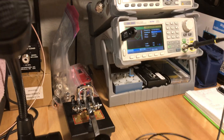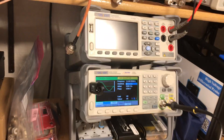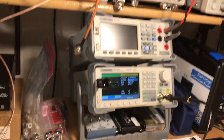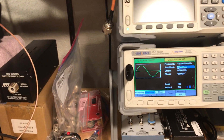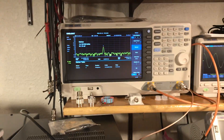The issue we were having is I didn't have a step attenuator — I only have a fixed 10 dB attenuator. And the newer Siglent function generator didn't go down that low; it only went down to about 0.7 millivolts, which was still too high to achieve 50 microvolts on the output.